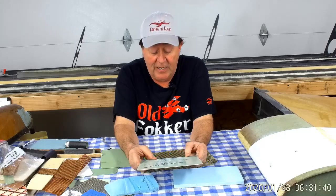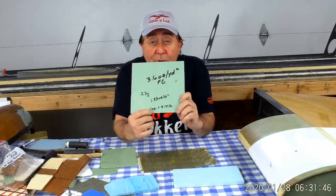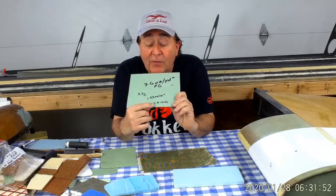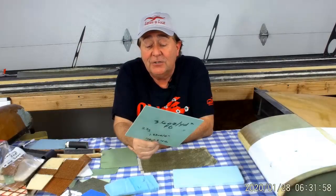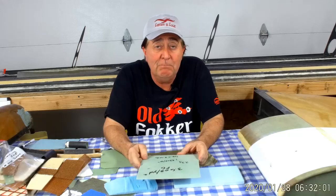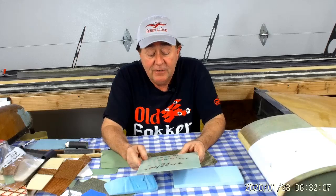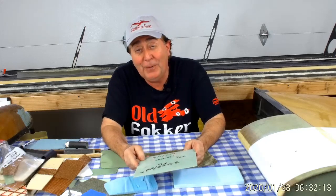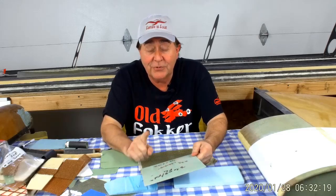I found a big driver: for every one ounce per square foot of wing, that adds eight and three-quarter pounds of weight. So if one structural method for the skins takes an ounce more than another method, I've just added eight and three-quarter pounds to my wing — eight and three-quarter percent of a hundred-pound target. That's the penalty for adding an ounce per square foot.